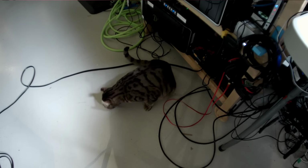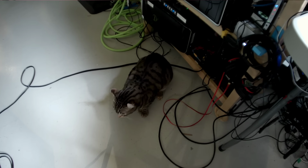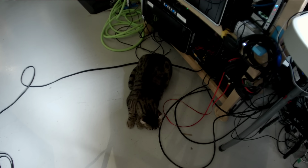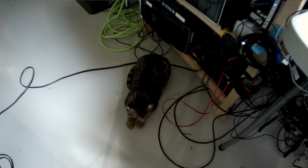So that started out as a little puck thing, and then the project grew, and I wanted it to also have an output component. That could have been a separate device, but I had this idea that people are going to want to point the remote at the thing that seems to have the most obvious user interface. So I figured the thing with the big vacuum fluorescent display should also have the remote receiver. So that's why the thing that was originally an infrared receive transmitter, pulse timer kind of project also grew a serial port.